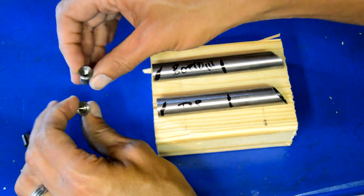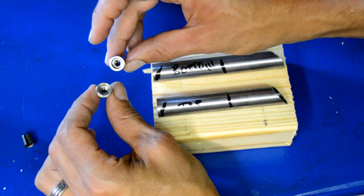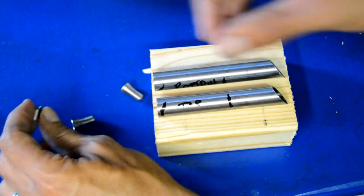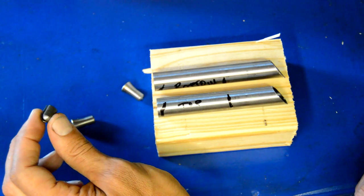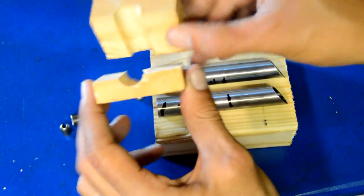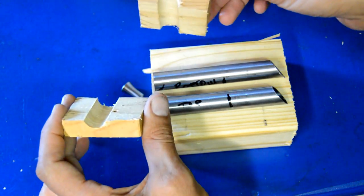I also got the little cable stops where the cables will run — I'm going to weld these up onto either side of the head tube, and I've got one cable stop just in front of the rear derailleur. I made an extra set of little wooden blocks — just a piece of wood, drill a hole through it, then cut it in half — to hold your work piece while you cut, file, or whatever.